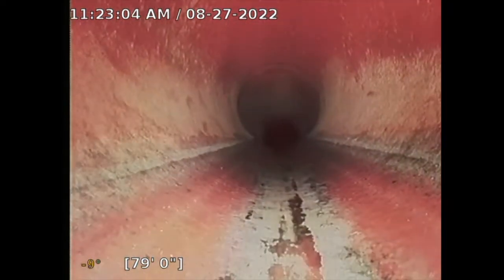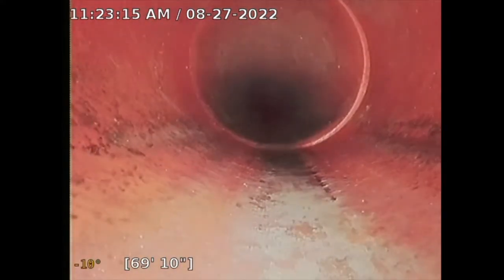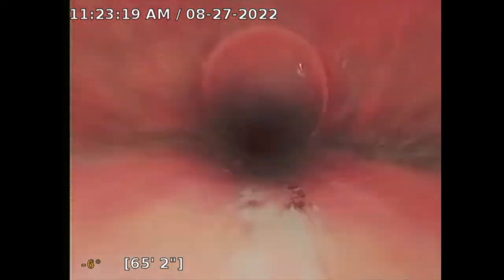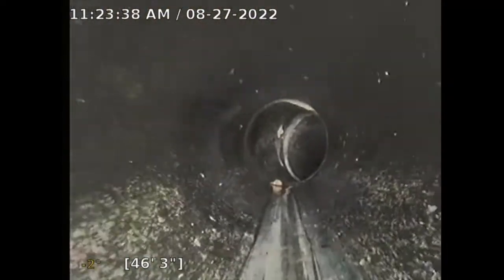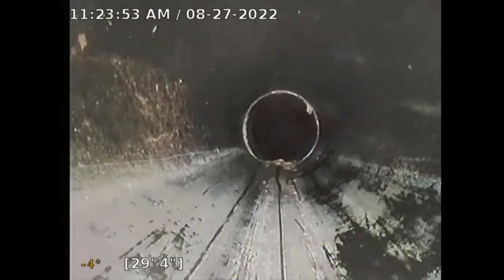There has been a repair to it. There's a few joints that do have minor tree root intrusion, but very minimal. The biggest one being that one in the picture there. So now you're getting a cleaner picture. Some of those joints do have those tree roots. Here's the ABS, retracting this. Out. This ABS line looks good. No issue with that.